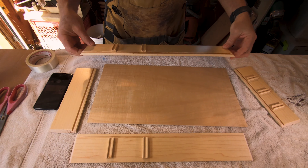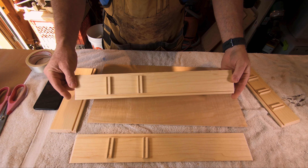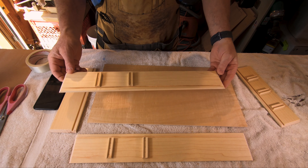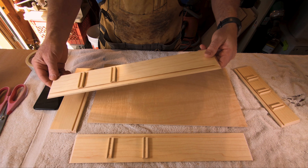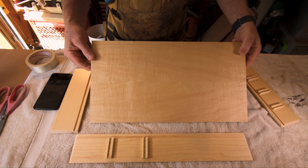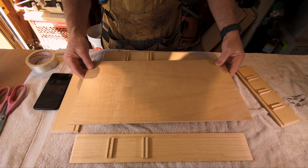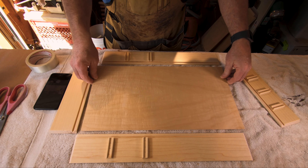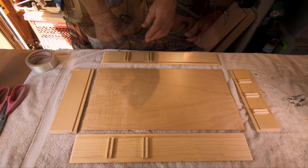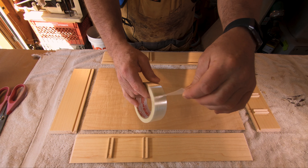Here's all the pre-finished stuff we did yesterday — the pre-finished flatware organizer. Yesterday I taped off all the ends and sprayed finish on both sides, top and bottom. We had a little piece of pre-finished maple quarter-inch plywood. What I'm gonna do right now is glue this thing up. First thing we're gonna do is take our packing tape.